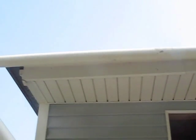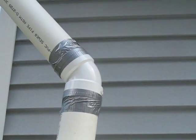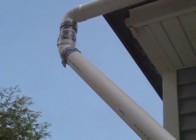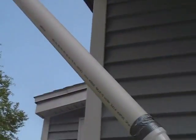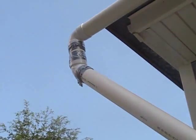As far as the gutter goes, you don't need to attach it to the roof in any way other than the clamping motion of the pipe itself. It'll hold itself up through all kinds of rainstorms — trust me, if this system can withstand the storms of Panama, it can definitely withstand anything Florida has to throw at it. Now, why did I use duct tape instead of PVC glue? I want this thing to be removable in case I want to relocate it or take it with me when we move again. PVC glue is a better system if you're sure you won't be moving it, but duct tape works just as well for my purposes and is part of regular maintenance.